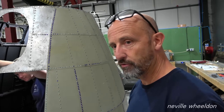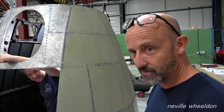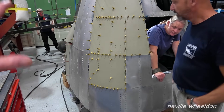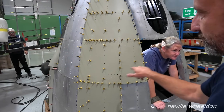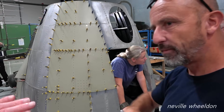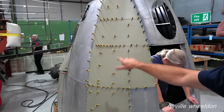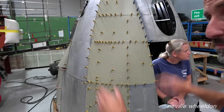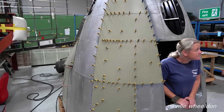I reckon by the time you come wandering around here, this will all be riveted up around this side. So on this side, do you start at the bottom and work up? Well, what I've learnt, the best way with all this curved malarkey is just spread your rivets out a bit — don't follow a line. Because you end up with that wave effect, and you're rolling all the material to another end. So just spread them about a little bit so you can get it all nice and squared and flat, then just start filling all the gaps in. Get it all tacked on, and then just start working our way around that side.